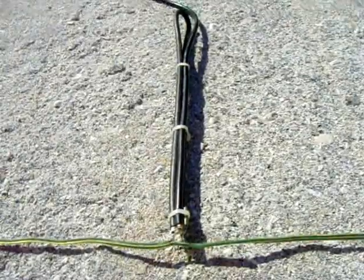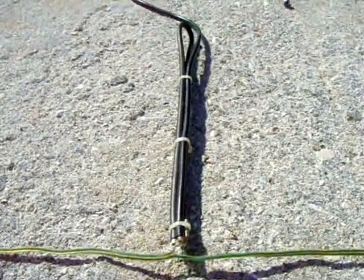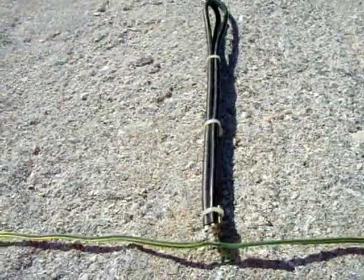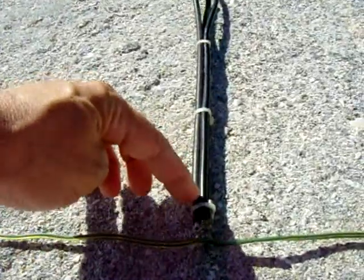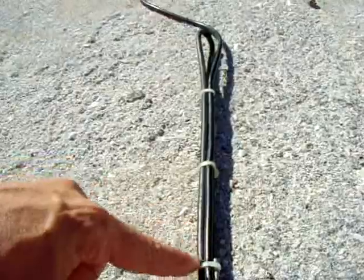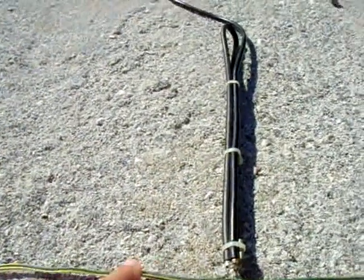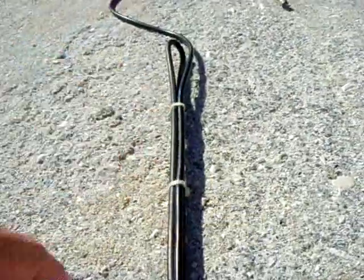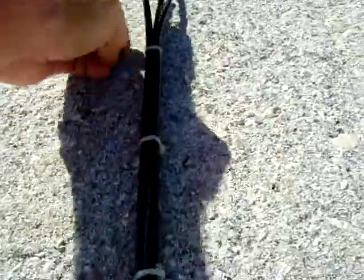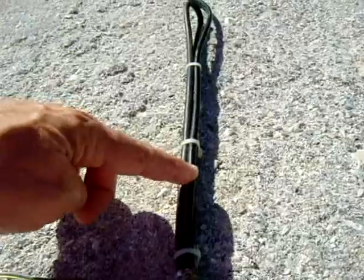This is the type of transmitting antenna you want to use. It's a folded dipole antenna, and it's made with regular coax — it could be RG6, RG8, or whatever. And this is a balun. This one loop that goes through and back is called a balun. This is roughly 288 to 300 ohms on the impedance, and the coax is 75 ohms. So that is designed to balance the radiating element here into the coax.